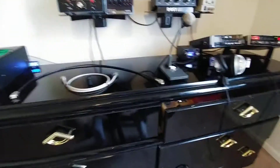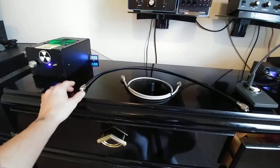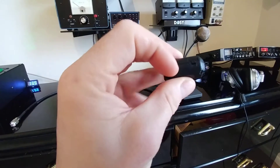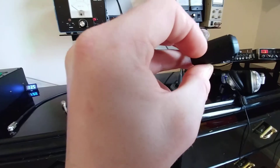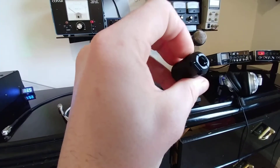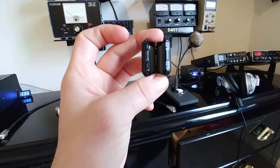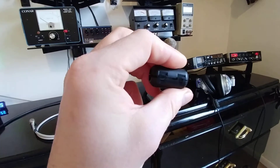So let's say your coax is connected to your radio — here's your radio, here's your amp. Here's your choke. Now we're going to talk about ferrite cores. This is a snap-on one, and they come in solid construction too — not two halves, just one whole core. This is Mix 43, which is the most optimum core to use at 27 megahertz.